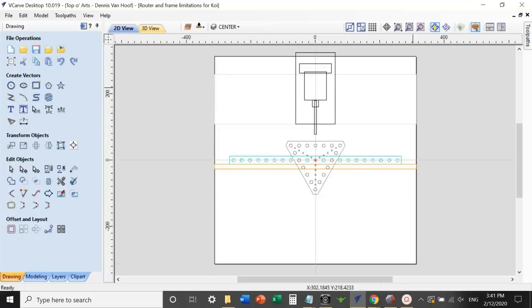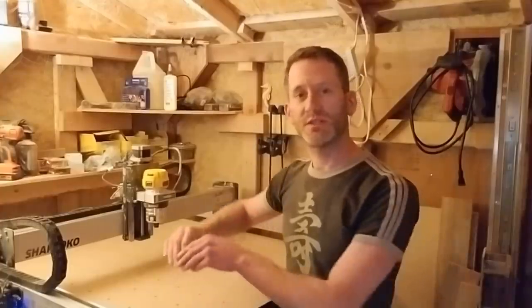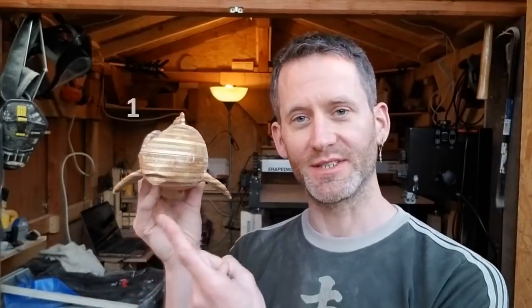So I designed a rotary mount with which I can carve stock from any desired angle, and as many angles as needed, by positioning the stock around the manual rotary B axis, which runs in the Y direction. In the case of this koi fish, which has a triangular shape, it is a three-sided project.